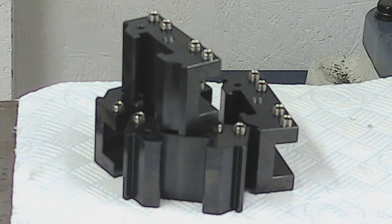We've got to the end of the cartridges at least. I've still got to make the height adjustment pieces which I'll do in a separate video. I've blacked them up and inserted stainless grub screws in the holes for now so I can use them in their current state. I'm going to make some proper hold-down screws per the originals with a square on the top - that will be in a separate video. I'll take one of them to the lathe and show you the fit onto the tool post.